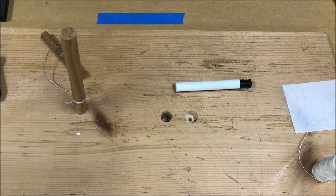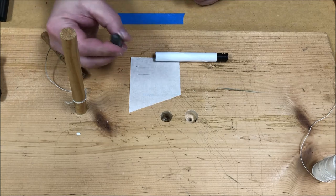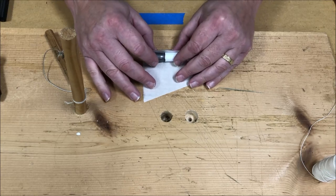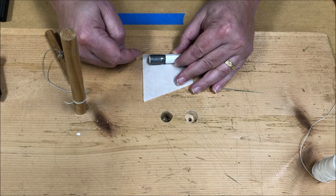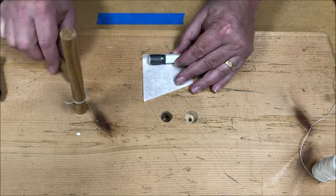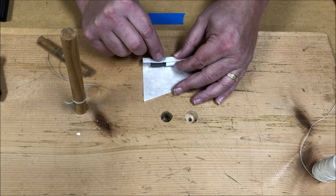Now, historically, the way the cartridge is finished: next up we have to wrap the bullet chamber, or the outer wrapper. That was done with the bullet and the plug — everything's wrapped around the powder chamber and the bullet with its plug. In theory this should give you the tightest wrap because you're not sliding it in after the fact. The end of the bullet should be flush with the end of these slits, though I like to leave just a little bit more space — maybe a sixteenth of an inch of extra slit beyond the base of the bullet — because I need the paper to get a good choke. As long as these slits come up to the shoulder of the bullet, you're fine.